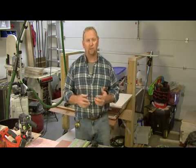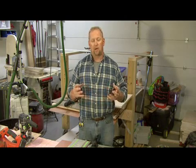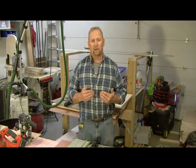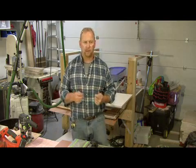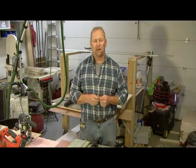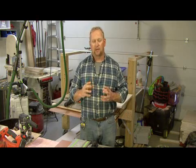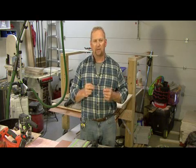Because they were built before a lot of our modern electronics came in, such as computers and microwaves and the televisions that we have now. So the demands for electricity are much greater, but also more consistent. Older homes with the type of wiring that they have and the type of amperage that's brought into the house tends to fluctuate quite a bit, and modern electronics does not like to have electricity that fluctuates. It can actually harm those devices.